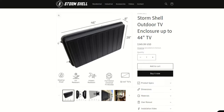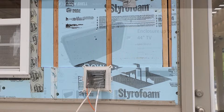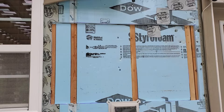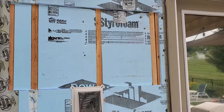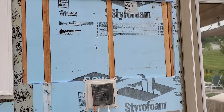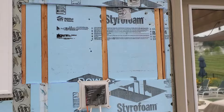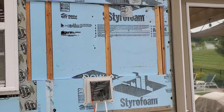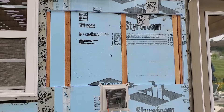At the end I'll wrap it all up by talking about some of the considerations. I decided not to film the beginning of this because it's a lot of tedious work, and your house might be different. One thing about this house is that the sides of it are three-quarter inch insulating foam instead of sheathing. It's not necessarily cheaper — I was told they do it for the R-value around here. With that said, I had to cut the foam out to the size I needed for a backer board, because the Storm Shell and its mount are not going to fall within the stud patterns between the window and the door.